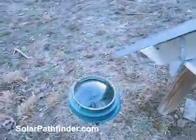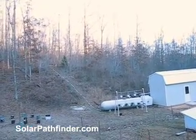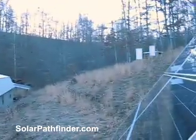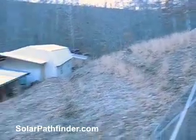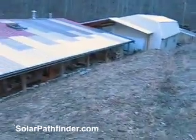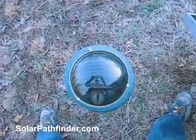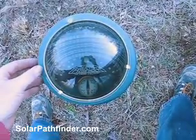I'm a little off-center of where I ended up putting them, but that's what I'm going to have to show you — put the Pathfinder here. If I went too far in that direction, those trees on the east shaded me until about 9 or 10, sometimes 11 o'clock in the morning. And going the other direction, I'm in the shade by 1 or 2 o'clock in the afternoon. That direction would have been easier because my whole setup — batteries, inverter, everything — is over near that barn. I never would have put the panels way up here on the hill because of the added wire cost, voltage loss, and power loss. But after seeing that this was my best place, ultimately this is where I put them, and I'm so glad the Pathfinder had that to show me ahead of time.